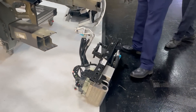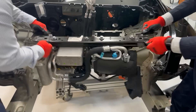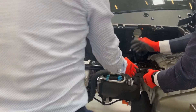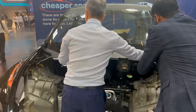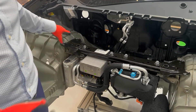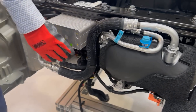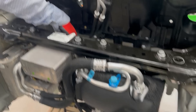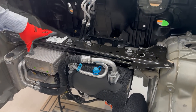So here we have the cooling beam. The cooling beam is a beam with all the elements and components for the cooling system, except the radiator. So you have the accumulator, condenser, compressor, and octavalve here. This is a complete cooling system compressed into this beam.